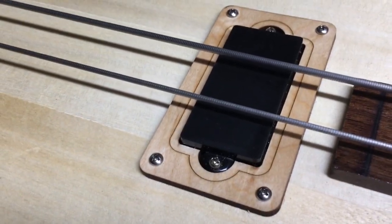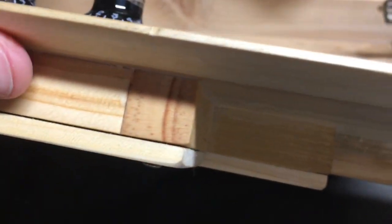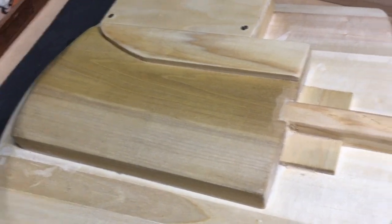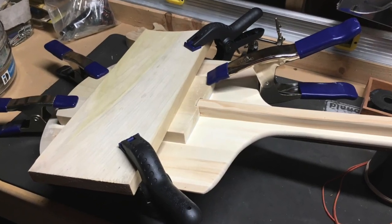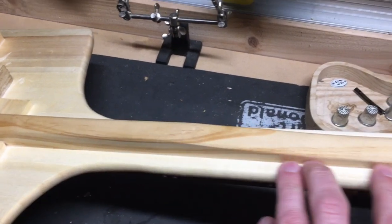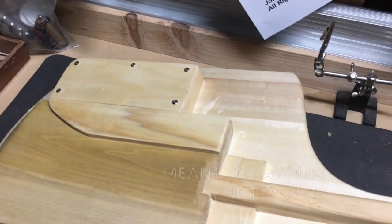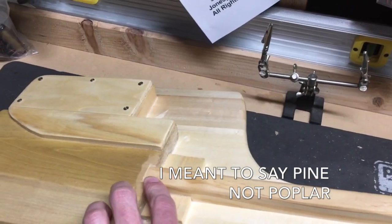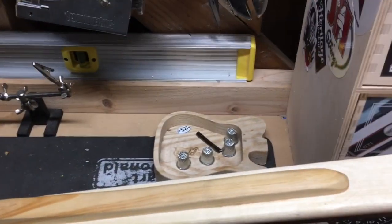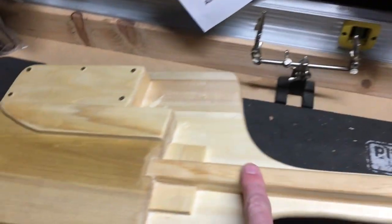My first mistake, I'll talk about it right now. Here, let's flip this up. So you can see I put another board behind. Maybe if I just flip it over, it's easier. There we go. I put another board behind to strengthen this, and then I put a little extra, a tapered piece of square dowel here. I just sanded it off and tapered it, as you can see there, to give extra strength to the neck, because the paddle here was not very strong. I could just flex it with my hands. So I wanted to make sure it was nice and strong. So I put this piece of poplar, and you can see I dadoed that in there and used a square dowel and just tapered it off. So you can see it gets thicker as it goes down. So that's kind of how I made this.